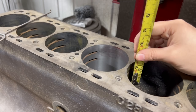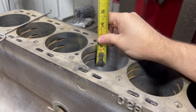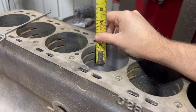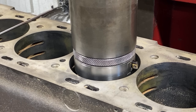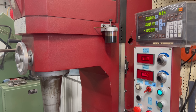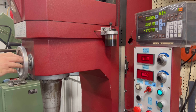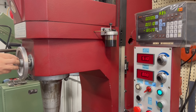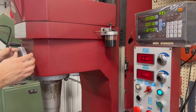The bottom of the second water passage is about 1 and 5/8 inches from the top of the deck, and I want our zero press section to go to about a quarter of an inch below, so with our second cutter we'll be cutting until we get a reading of 1 and 7/8 inches on the digital readout. I let the cutter run with the z-axis feed engaged before disengaging the feed a bit above 1 and 7/8 inches and finishing by hand to avoid overshooting the number.